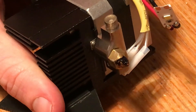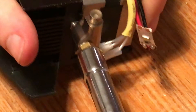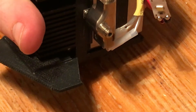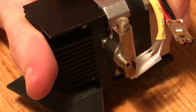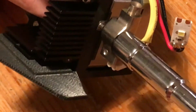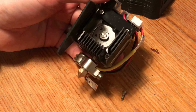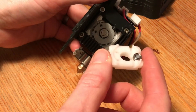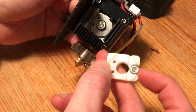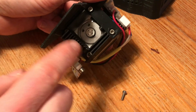What I've done now is heated it up and I'm going to take the nozzle off — don't take the nozzle off without heating it up first. So let's take this thing off and replace it with one of the nozzles that comes with the pack. This thing's cooled down now, so I'll try this fresh nozzle. I'll get it nice and tight, because a loose nozzle can be a cause of sadness later on. I'll put back the guide with the little roller and try an extrude on the machine with the cover off to see if the stepper motor is actually moving.